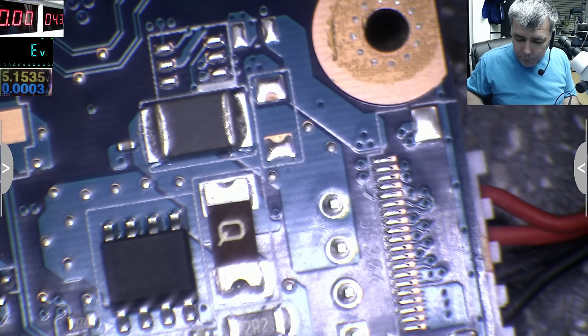That's the screen, the display. But don't try to do what I did with the tweezer on the rest of the board, because you see you have a lot of MOSFETs here. Don't try it. You'll make things worse. Actually, these are switching, they are not wires. Obviously when you bridge something, it's like a wire. You know what I mean? Don't try it. I'm just speaking about the first two MOSFETs starting from the charging port. That's all. After that you can forget about bridging MOSFETs. Just forget about that. Don't even try. Like I said, they are doing a pretty complicated job, the MOSFETs.